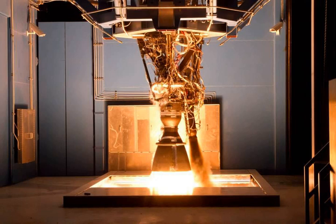The Merlin 1B was enhanced over the 1A with a turbine upgrade, increasing power output from 1,500 kilowatts (2,000 horsepower) to 1,900 kilowatts (2,500 horsepower). The turbine upgrade was accomplished by adding additional nozzles, turning the previously partial admission design to full admission. Slightly enlarged impellers for both RP-1 and LOX were part of the upgrade. This model turned at a faster 22,000 rpm and developed higher discharge pressures. Turbopump weight was unchanged at 150 lb.